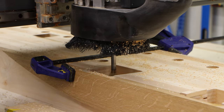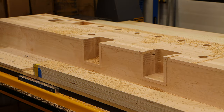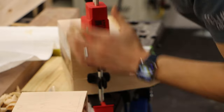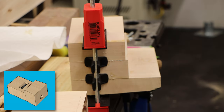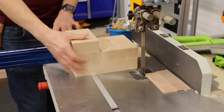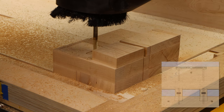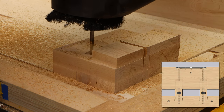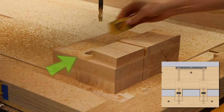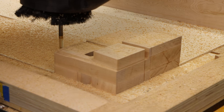On the fixed slab, dovetail shaped slots are cut 4 inches wide and 4 inches deep to hold the loose tenons. The tenons are held in place with dovetail shaped ends and two large bolts. The mechanical joint and the long grain of the tenon offer strong anchor points for the vise bushing. For the vise to open as wide as possible — 5 inches or so — the screw will need to recess into the fixed slab the same amount as the air gap. You also need enough meat to hold the bushing and a screw long enough to go through the sliding slab, a range of 5 inch air gap, and still be securely attached to the bushings in the fixed slab. You can start to see the problem.